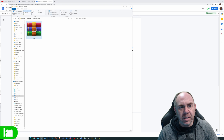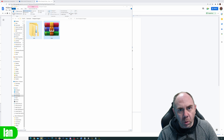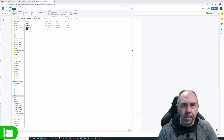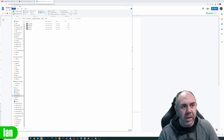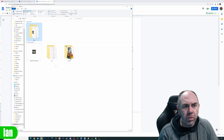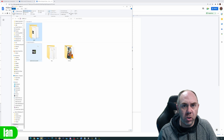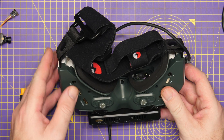Once you've downloaded the file, you should have a zip directory called ELRS. Extract that, which will give you a folder called ELRS. Inside that is another folder called ELRS, and within that are the firmware files for the backpack functionality. What you need to do is copy the folder called ELRS that contains those four files — not the outer folder with the folder inside it — and paste that folder onto the SD card that you're going to put in the goggles.